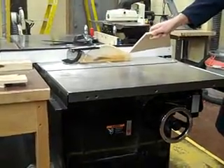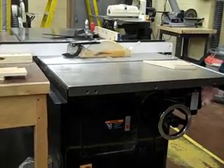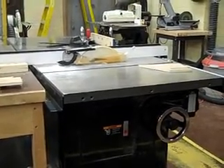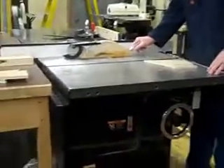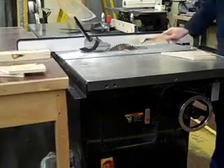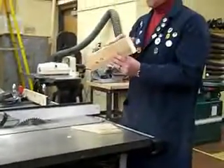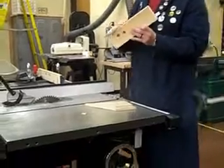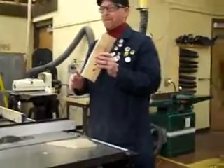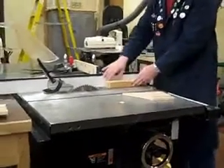Okay. Now see all that piece of wood stuck in there? Keep it up and out. I'm going to set everything down, hit the red switch, and just to be safe I'm going to hit the little switch too — wait for that to stop. I went right through the knot nice and slow. So what I've done is I've got a nice straight cut. If this side was squared off — if we were at a 90 and a 90 — this side then would be at a 90 and 90. So I'd be able to take this and load it on this side and get a nice flat 90 degree cut right here.